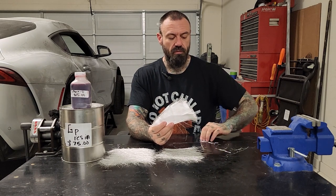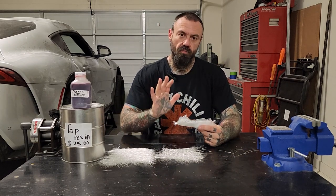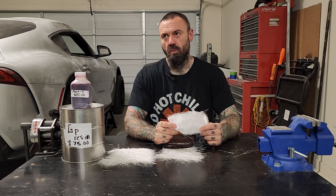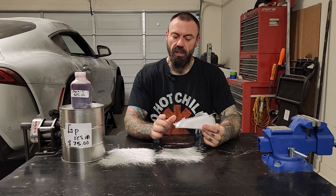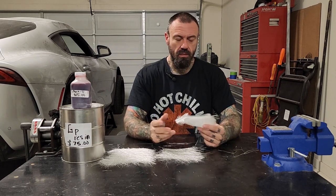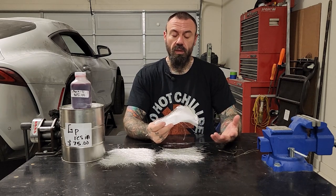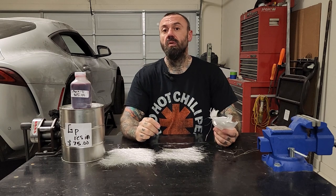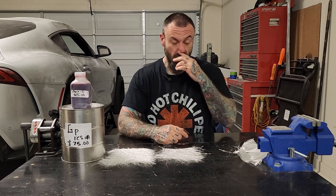A gel coat is basically, for lack of better words, a very thick primer that is sprayed into a mold. I really do not like gel coats. Companies that use gel coats try to promote their parts as paint ready, but in my experience it leads me to believe there may be some shoddy work — that their mold is not the greatest. I've used gel coats in the past and gone away from them. Every manufacturer and builder has their own unique style. I'm not talking trash, just speaking personally. So we're going to take this cloth and set it aside — you're not going to be using it in this process.